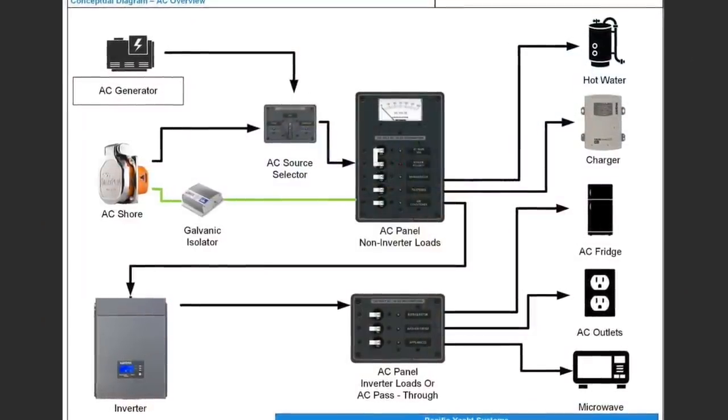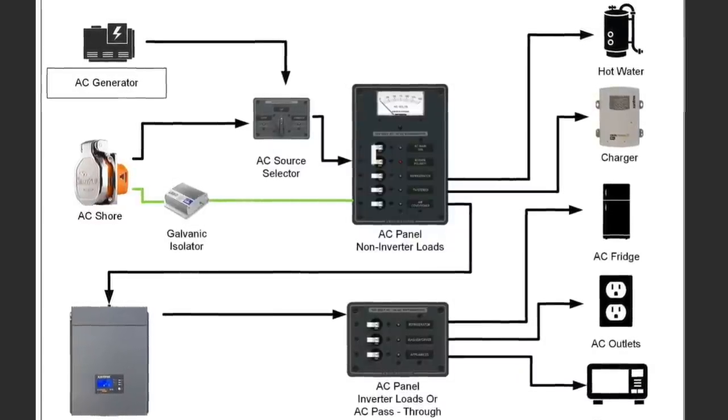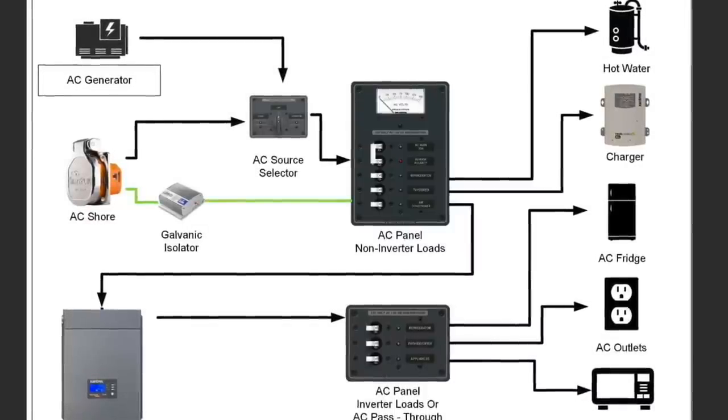The AC system of a marine electrical system pretty much looks like this slide. You're going to have sources of AC coming on board — on the left-hand side, you have shore power and a generator. These are pretty much the only two sources of AC on a boat. You can have multiple generators on larger vessels — 100-footers, 120-footers might have three generators: port, starboard, a night gen. It doesn't matter how many generators or shore power receptacles you have. A Bayliner 4788 has three AC inputs: line one, line two, line three. It's just more sources running the panel.